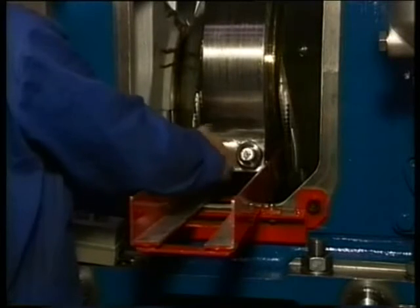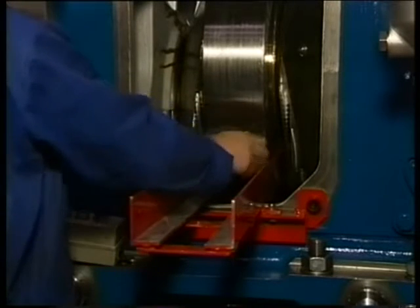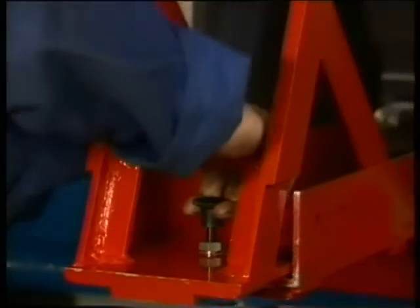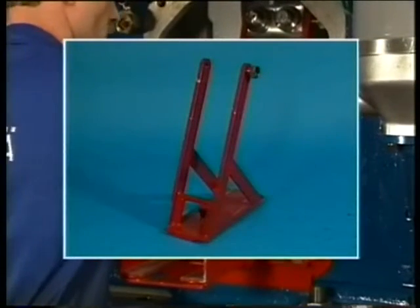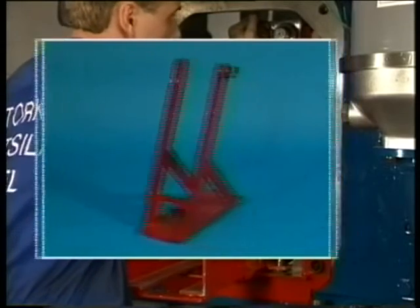Now first remove at exhaust side the two lower nuts of the bearing cap in such a way that the second carrier can be mounted. Pull up the blocking pin when the carriers are moved inside. Fasten the carrier of the lower bearing cap by turning the blocking pin into the locating hole at one side of the cap.